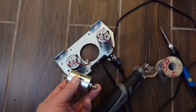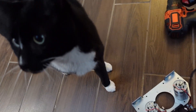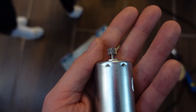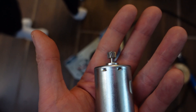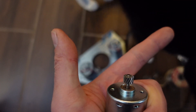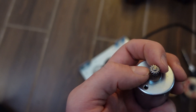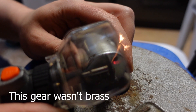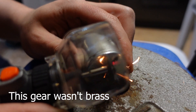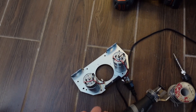First step is to Dremel the old brass gear out. When you Dremel these, you will see sparks when you hit metal, but the brass should not spark — that's your litmus test. You also don't need to cut all the way through; just weaken the brass enough that you can pry it off. That way you don't mar the center rod, and even if you do mar it slightly it's not a big deal.